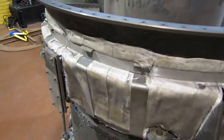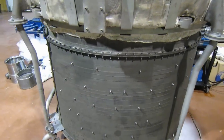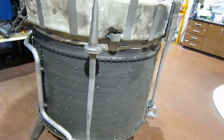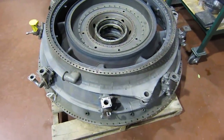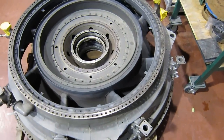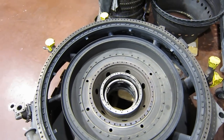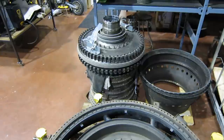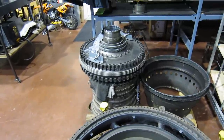These engines are both built by GE. Actually the LM2500 was derived from the CF6 and it shares a lot of the same parts. This part is the turbine rear frame of the LM2500 and it is immediately aft of the HP turbine, which is also the core turbine because it turns all of the compressor elements that make up the core of the engine or the high pressure system. There is the high pressure turbine without any blades — we will be building that up over the next week or so.